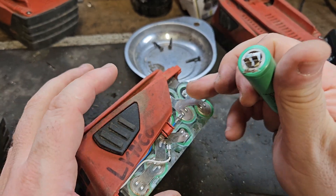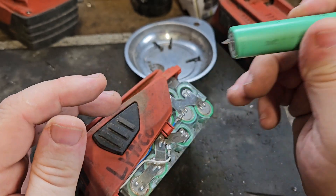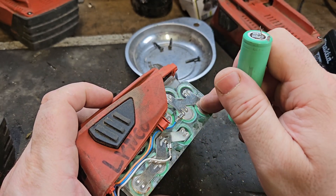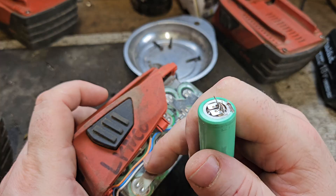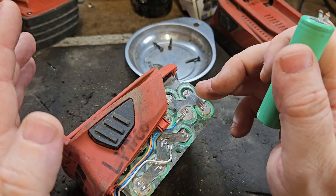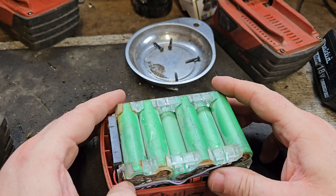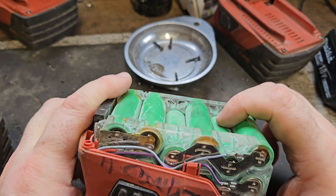A lot of people think that if a cell goes below 2.5 volts it probably permanently damages the cell. Ideally, if you open a pack you'd want these cells to be sitting between 3.3 and 4 volts roughly, and across the pack you'd want equal voltage. If some are higher and some are lower you get cell imbalance, and even though the cells aren't damaged, the inequality can render a battery pack completely useless. I have videos showing how to bring up the lower banks and equalize the battery balance — they're on my channel, and I may do more cell recovery videos.